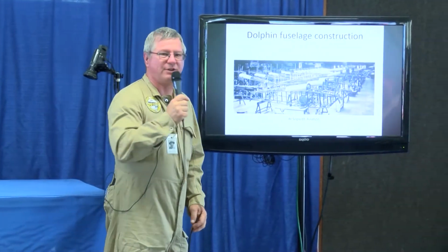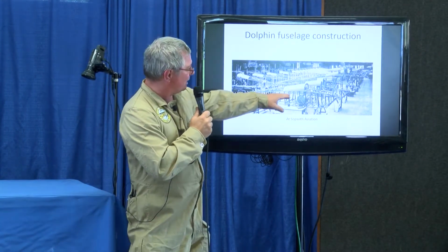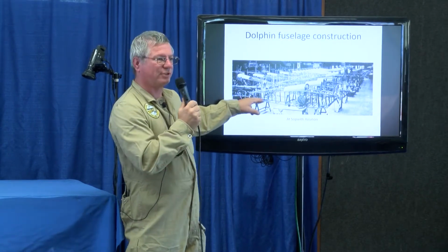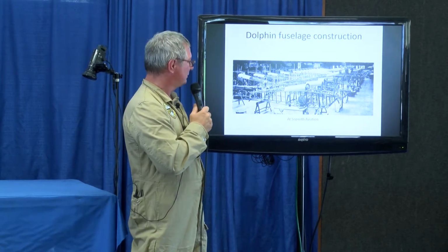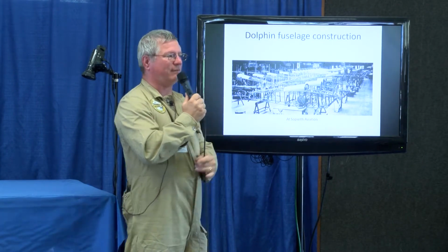Again, if you looked at those pusher aircraft, you can see the longerons and the vertical and horizontal spreaders. It's the same thing on the tractor aircraft. Most of your aircraft are actually a structural truss. So you have four longerons. It's built like a bridge. After the bridge structure is completed, then they put formers on to give it a rounded shape.